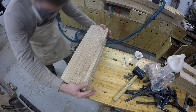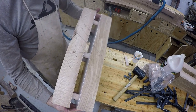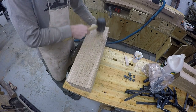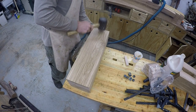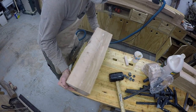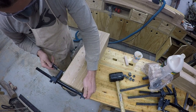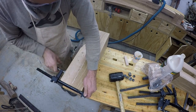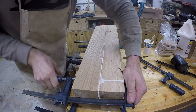The glue I'm using throughout this entire build is Titebond III — the Ultimate Waterproof version with the green label. They make three versions: regular red label, blue label premium, and green label waterproof ultimate. They all work great, but for my own peace of mind I wanted to use the best. I'm also using one-inch chip brushes from Harbor Freight — they work great for getting into spaces. Once worn out I throw them away, and I can cut the bristles down to make them stiffer or leave them long for different projects.